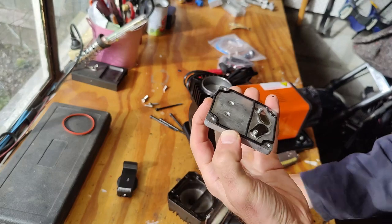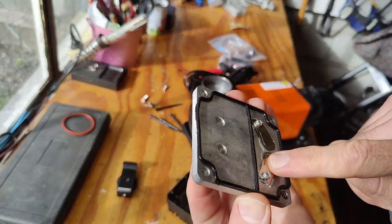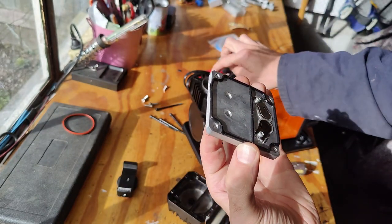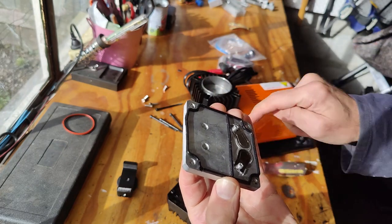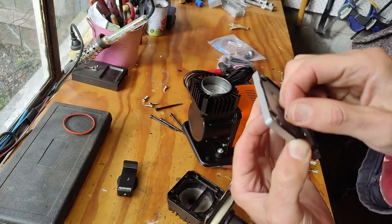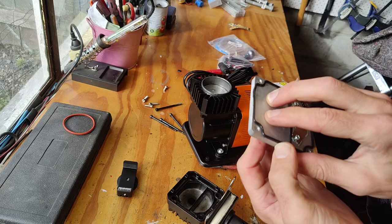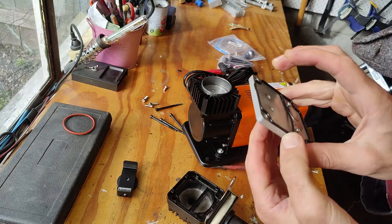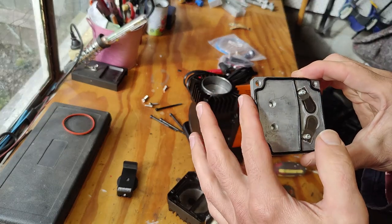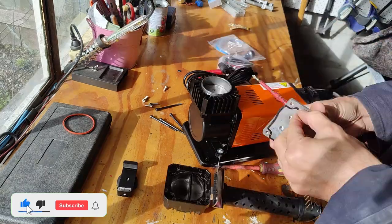So I think what we need to do is to fully remove these two valves, so the air is able to come free from the piston chamber and out of the hose, and I need to block off these two permanently, so no air gets inside, and that way we have a push-pull system. So that's the theory. Let's do it.